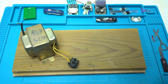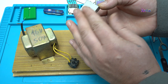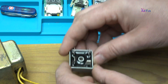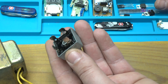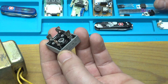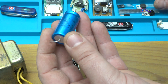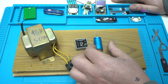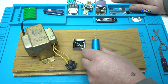This beautiful all-metal bridge rectifier has a hole in the center so you can mount it on a metal heatsink. It can handle up to 50 amps. The last component I will use is an electrolytic capacitor — 1000 microfarads at 40 volts — to stabilize the voltage coming from the bridge rectifier.